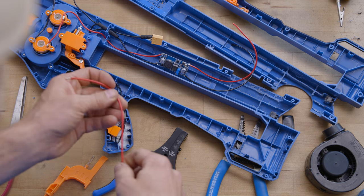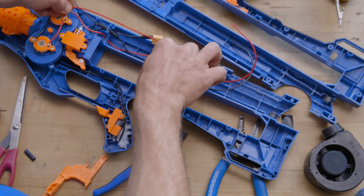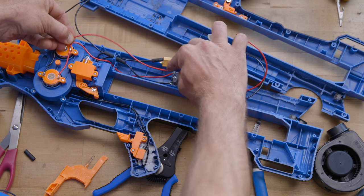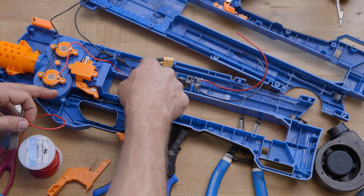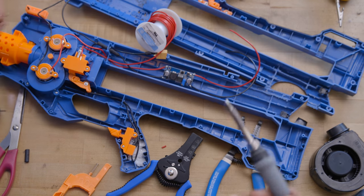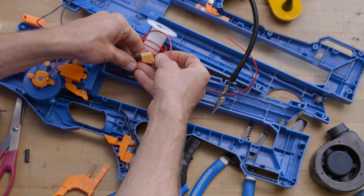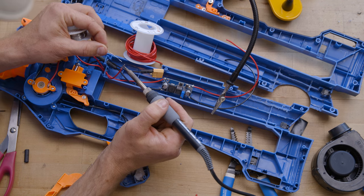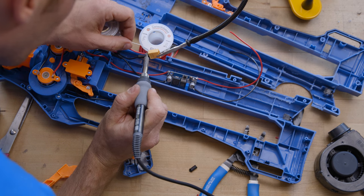Now we've got one last wire to run back to our battery, and that's our positive lead. So our positive lead will go here. We need to wire this from our XT60 connector, or whatever connector you're doing, or your battery source, all the way back to tie into this same line. Essentially it doesn't matter where you tie in, but I just find it easiest to tie in on the same spot there. So now that we've got that there, we've got one final connection to make, and that's to our XT60. Heat shrink the last connection here for the positive battery terminal.